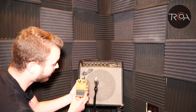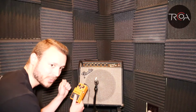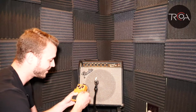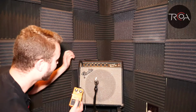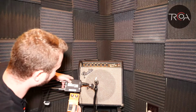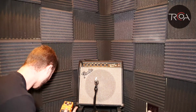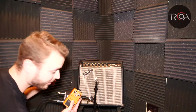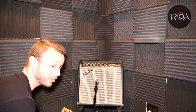Anytime we're using a pedal board though, especially if you're trying to take a DI, the DI still has to come first before the pedal. Normally when you're using a pedal, it goes guitar straight into the input of the pedal, straight out of the pedal into your guitar amp. That's normally how our signal flow is. But if we want to take a DI as well, we got to go from guitar into the DI, then come out of the DI into the pedal, out of the pedal into our amp. So that way we're keeping the signal that is coming from our guitar into the DI box that's split straight into our signal clean the whole time, even though we may have affected or distorted other channels that are going through the amp.